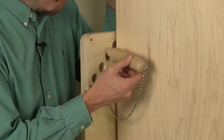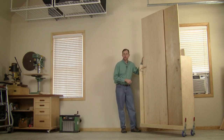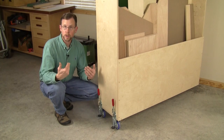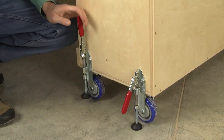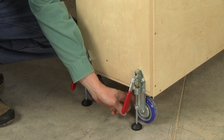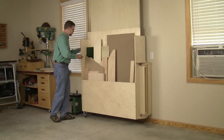For safety, we've incorporated a couple of pegs that fit into a series of holes, which you can lock into place to make sure your plywood is always upright and secure. The pegs are chained to the project so they're always within easy reach when you're loading and unloading supplies. You also don't want the cart rolling when you're trying to load or unload a hundred-pound sheet of MDF, so we've incorporated brakes over the casters — they're large push-action clamps you can activate by foot, which raise the casters just far enough off the floor to immobilize the cart.